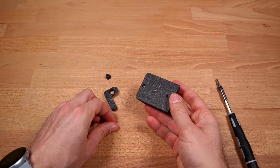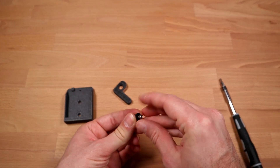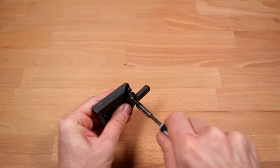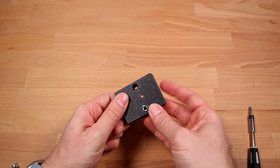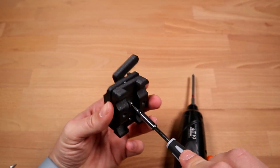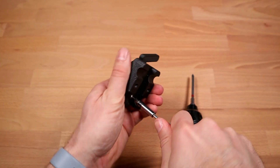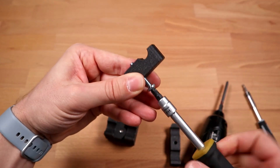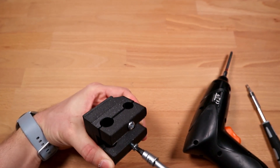First, let's assemble the camera mount. To attach the lever, we need an M3 hex nut and an 8mm screw. The bearing is simply put through the lever and screwed safely in place. As a next step, we are inserting an M5 hex nut on the back side of the camera mount. The front and back side of the camera mount can then be screwed together with M3 screws. The mounting blade for the camera is held in place with a lever. The final step in the camera mount assembly is preparing the holders which will hold the camera mount on the aluminium pipes.